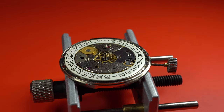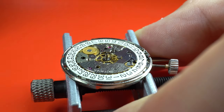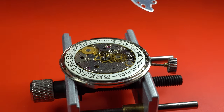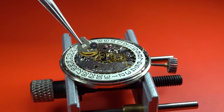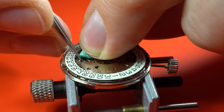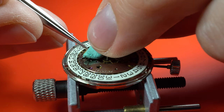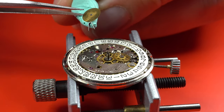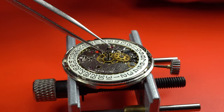Starting on this side of the watch to disassemble — first taking out some screws. This is mainly the keyless and calendar work protection. There goes one part, which is just a little protection bridge. This side is concerned with the calendar, with the flipping of the date. Here I'm taking a little bit of this greenish-blue material called Rodico — you could compare it to Play-Doh, but it's really nice for watchmaking to clean parts and keep something in place. And here is this little spring that is flipping over the date.